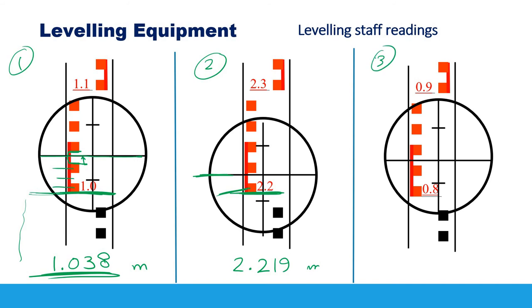Example 3 — practice this carefully, because inaccurate readings risk your entire project. From the ground to this point is 0.8 meters. Count the centimeters: 1, 2, 3 — so 3 centimeters. Estimate the millimeters: the middle line appears to be exactly in the middle of this centimeter, so 5 millimeters. The reading is therefore 0.835 — meaning from the ground to this point is 0.835 meters.